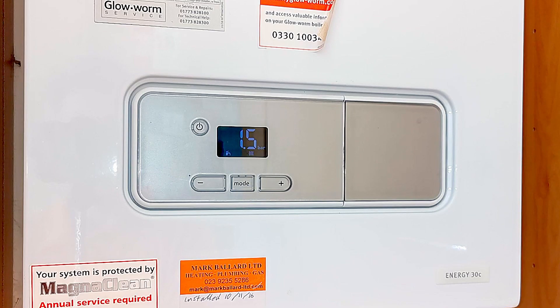This little pressure sensor is 95% of the time the problem when you get the F75 fault. You can see the boiler is still going through its startup process — the pump is trying to run and pump the water around — but the boiler is looking to see that pressure sensor change from 1.5 to maybe 1.6, 1.7, or 1.8. It's not changing at all, and so — there we go — F75. We're right back to where we started.